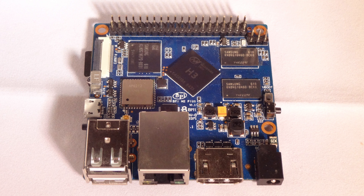Right below the serial pins you can see the main heart of the computer — the Allwinner H3 chip. On the right side of the chip are the RAM modules, and on the left side you have the Wi-Fi chip, its external connector, and 8 gigabytes of internal flash. On the bottom side of the board you have two USB ports, an Ethernet jack, HDMI port, and a DC power jack. On the left side of the board you have a power button, a micro USB port, IR in, a CSI camera connector, and right below that a micro SD card slot. On the right side of the board you have a U-boot button and a reset button.